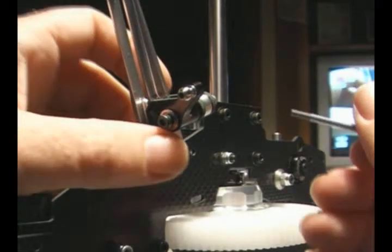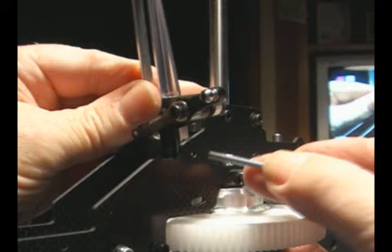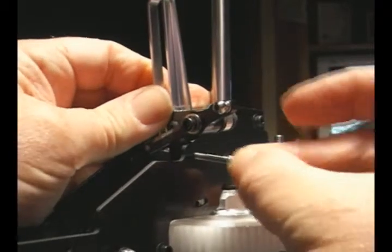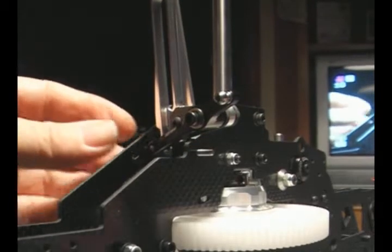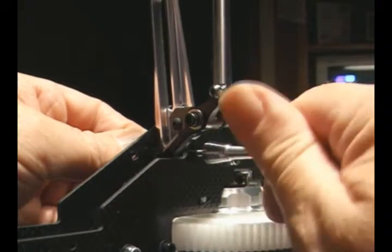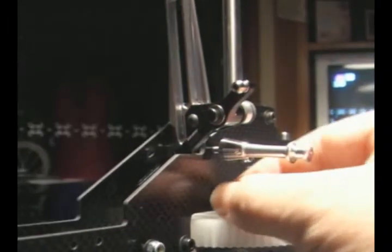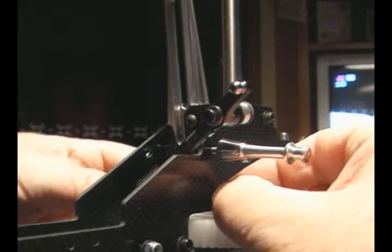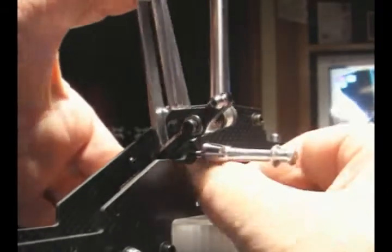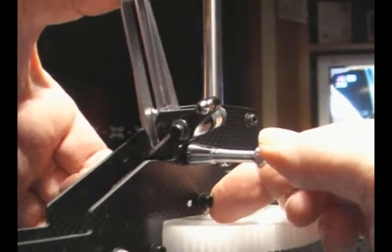Now we can mount up the anti-rotation bracket onto the frame, lever to the back. First off, we have an M3 by 28mm bolt and a threaded rod that goes through the top hole, and then our threaded canopy standoffs will be Loctited down on there. The bottom is secured by another one of our M3 by 32 collared bolts, and this is in an oval on the helicopter, and this means the anti-rotation bracket can pivot on the canopy mount threaded rod, and that will allow us to take the swash in and out.